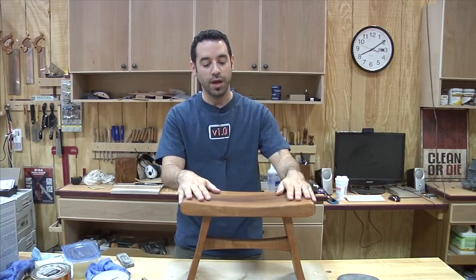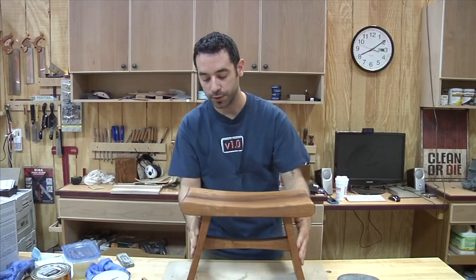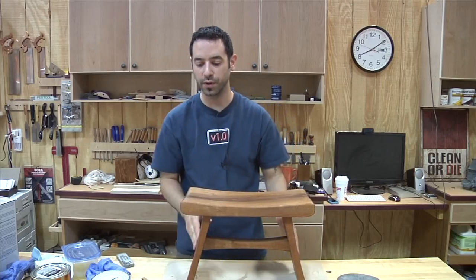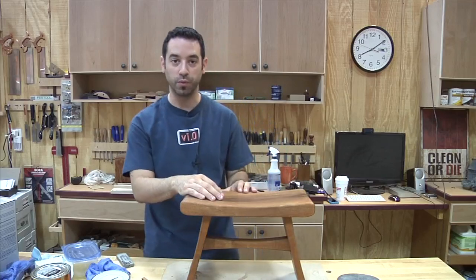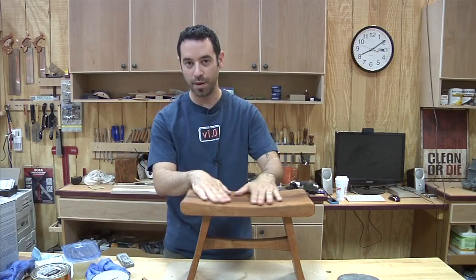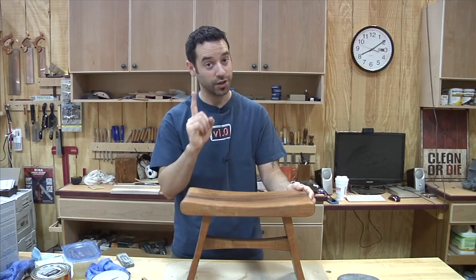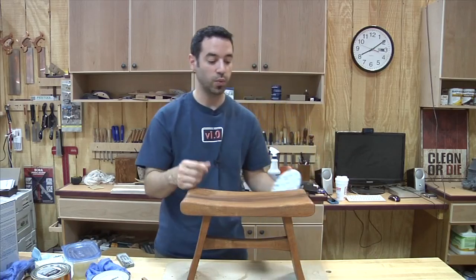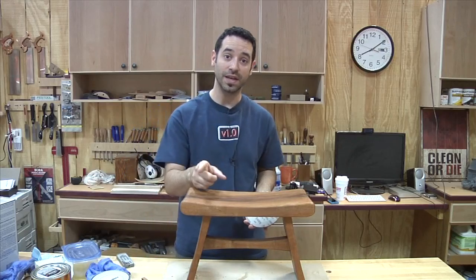At this point, if you start to slather on more coats of finish, it's okay, but feel the surface. It's going to be a little bit rough, you know. There's things that settle into the finish as it dries. There's just particles of wood that stay on the surface, so it's probably not going to be smooth enough to just go with the next coat of finish. So here's a little tip, and this is one of the ways that I end up with absolutely glass smooth finishes, and that is sanding between coats.